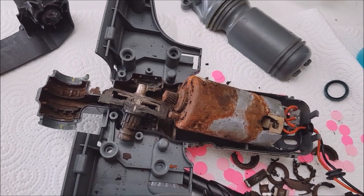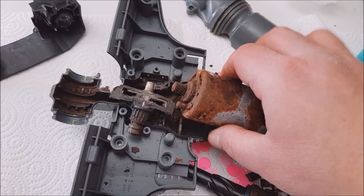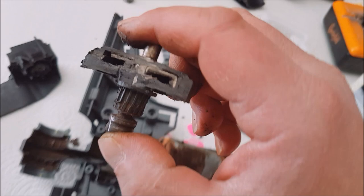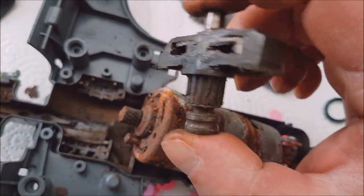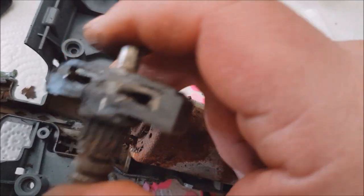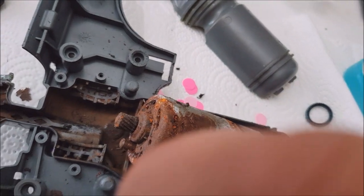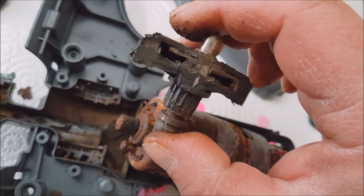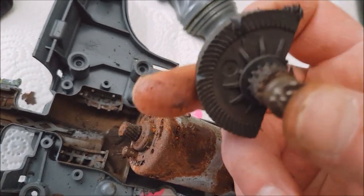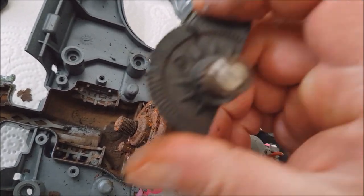When it worked, it was a beauty — really. So why did it quit? It quit because it was programmed to do so. This is called programmed obsolescence. There is absolutely no corrosion protection inside the clutch — a safety clutch which is supposed to work in a wet environment, very close to water, without any protection. When the overload clutch fails, the pinion will machine the plastic gear exactly like we see here.